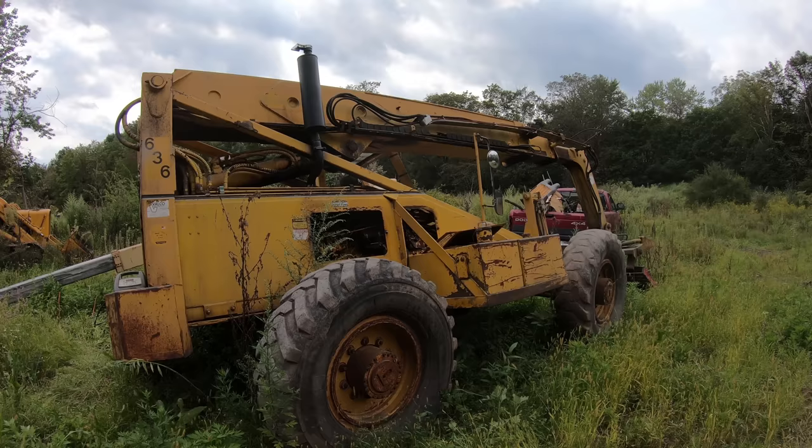So I knew I wasn't getting away that easy. So, kind of bad news here. I got an exhaust leak, and it's probably most of what I'm hearing, right below this whole assembly, right at the bottom. I could feel a massive exhaust leak coming out of there. I don't know if it's a crack or if it's a hole. I'm not sure why that would be there. Hopefully I don't need a new head, and hopefully it's something to do with the return port there.